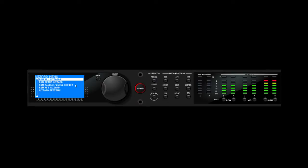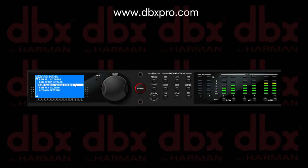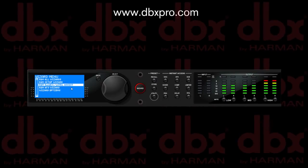After running the auto EQ, you may also need to recheck and readjust the amplifier's attenuators and limiters due to the change in gain from the graphic EQ. You can also run the AFS wizard if needed.